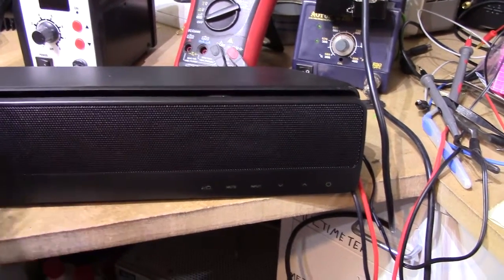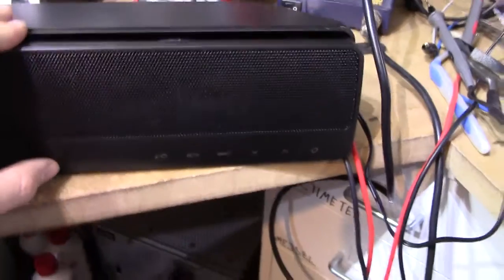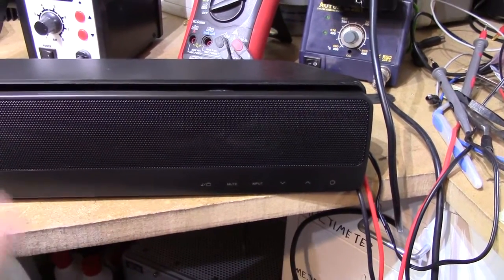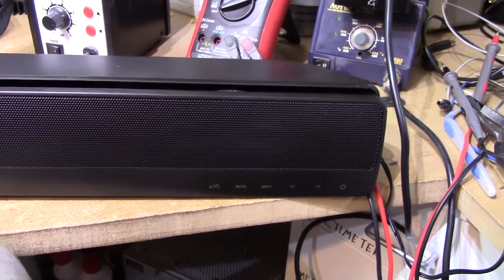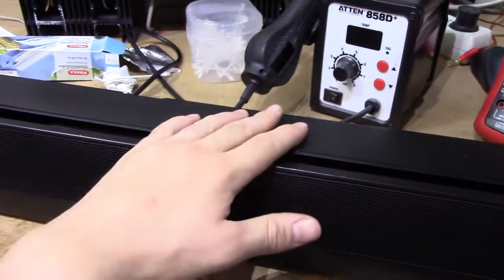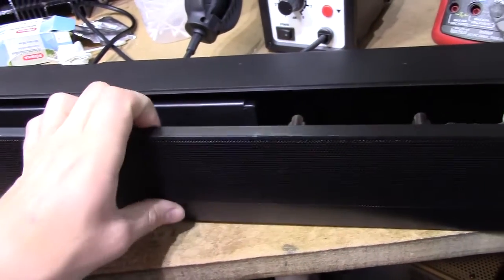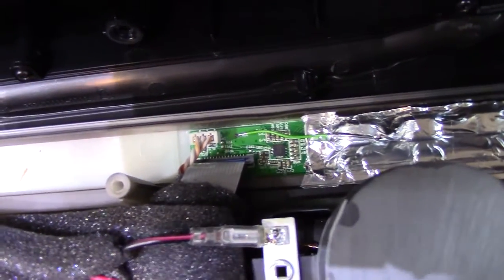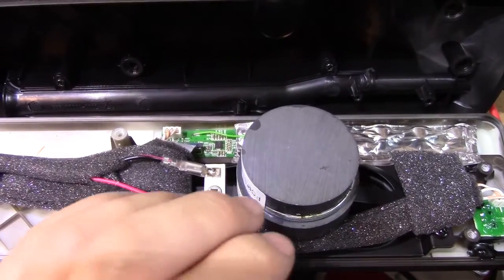Okay, so I just tried to fire this thing up, and it was so bad that it would barely even register any input on the front panel. I tried to switch source and it just wouldn't respond, it wouldn't do volume control, it wouldn't even react to the power button. So, since I know that the caps on the board are okay, I took the thing apart again and started looking at the actual front panel of the capacitive touch controller. I started by putting some contact spray on this ribbon cable, which didn't do anything. Although I did get it to turn on and react to input,